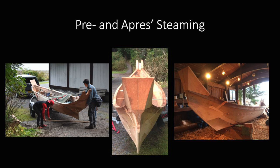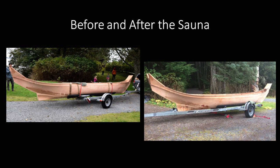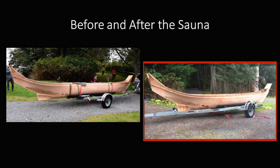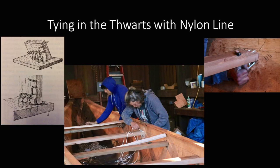It got wider and you can see how the ends changed shape. On the left, before steaming, you can see the curve at the bottom — the sides parallel and rounded outward, kind of sagging over the trailer. After steaming, the bottom is straight, the ends are higher in relation to the bottom, and the sides are lower. The entire thing changes shape. If you haven't anticipated all that, it doesn't work.